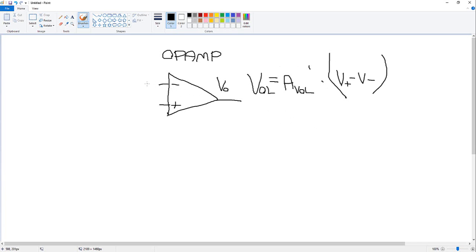This is the basic formula of the operational amplifier. This means that if the positive input voltage is a little higher — very little — than the negative input, so V-plus minus V-minus will be positive. Since Aol is a very big number, we will get a very large output — essentially the positive supply voltage connected to the amp.